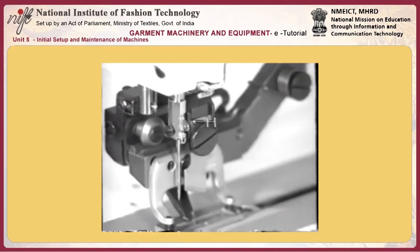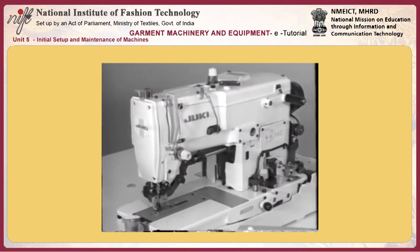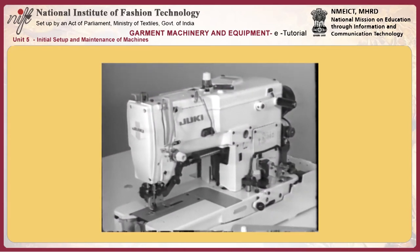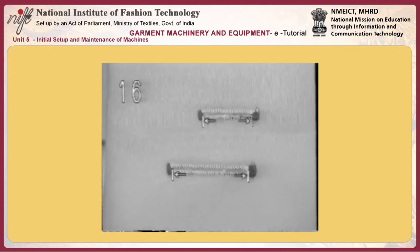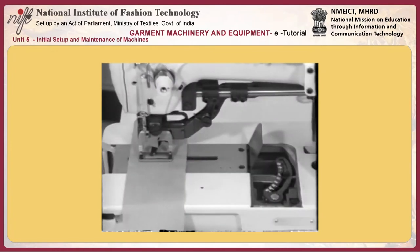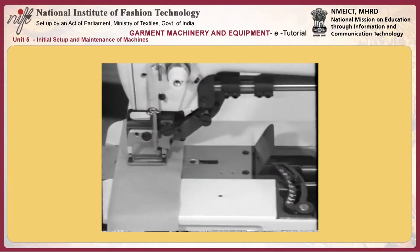Adjust tension E to be applied during winding of the bobbin to approximately 20 grams. If the correct tension is applied, not only neatly finished seam crest will be produced for parallel sections, but idling of the bobbin will be prevented.